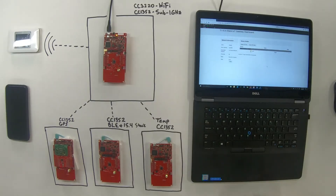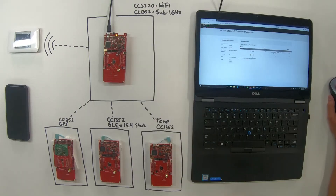Connect time is a function of the noise around you, the number of channels you're hopping on, and whether you're in frequency hopping, beacon mode, or non-beacon mode. That can be improved or lengthened depending on your circumstance. So we've got information here on the dashboard — it's got the GPS node and a picture showing it's a GPS sensor. We've got coordinates printed out in degree decimal minute format, and we've got the RSSI, the received signal strength indicator of the sensor.